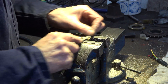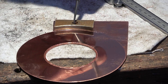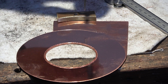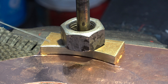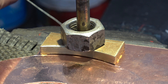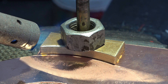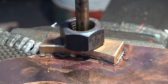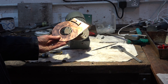I'll just shine up this face with the file so it solders properly. I don't want this to float away on the solder and end up somewhere else, so I'm going to drill a hole through this to correspond to this 8mm hole and drop something through to keep it in place. I'm going to use fine electronic solder because there's much less chance of pushing the part, but I have put flux underneath. The solder's flowed under and I've managed to keep it off the plate — it's on there in the right place. The next job is to trim the excess copper off.